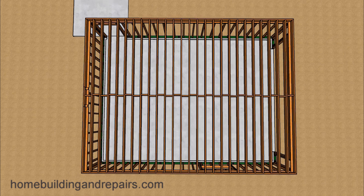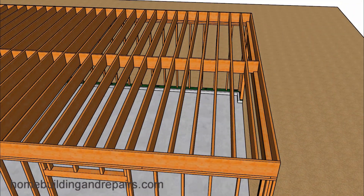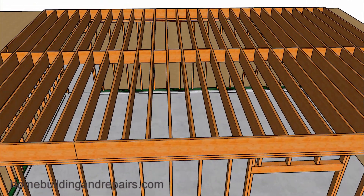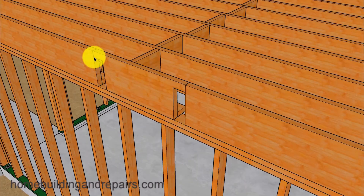Next step, let's go ahead and install our floor — 12 inch on center, 2 by 12 with mid-span blocks. Let's zoom in for a different view. We have our drywall backing for the ceiling, along with our stair deck connection. We are going to slide a couple of beams in here. You could always cut this out of one piece of lumber instead of notching this board over the beams, but we are going to be dropping the beams here.